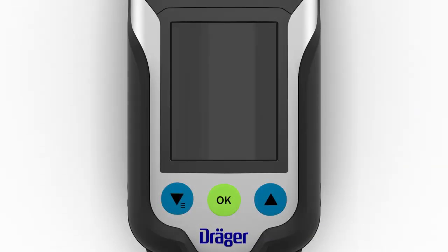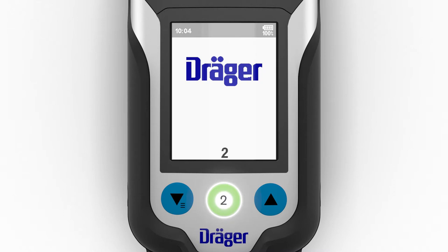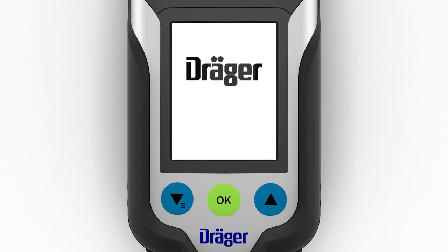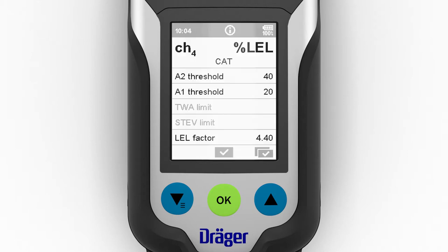The X-am 8000 is turned on by pressing the green OK button for 3 seconds. Once successfully turned on, the device performs the following actions. The display shows the startup screen and the current software version. A self-test is then run. Once successfully started, the LEDs flash, an audible signal sounds, and the vibration alarm is activated.